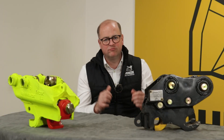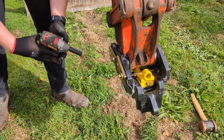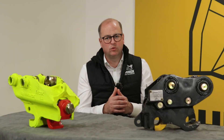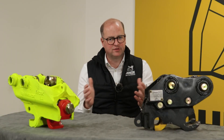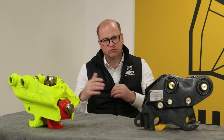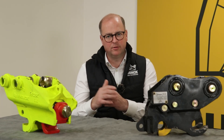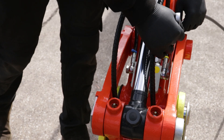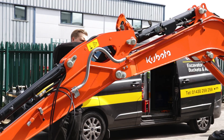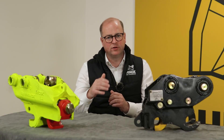This process doesn't require any technical or hydraulic knowledge — it's purely like mounting an attachment to the end of your machine. In reverse, the manual quick hitch is easy to take off for servicing, repairs, or if you wanted to use another kind of attachment. Installing a hydraulic coupler is more time consuming and can take anywhere between three or four hours for full installation, or one to two hours if your machine is partially piped down to the dipper end.